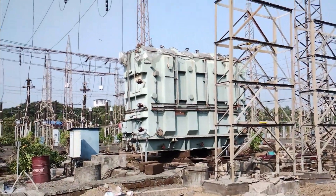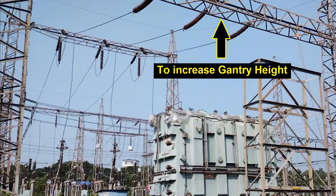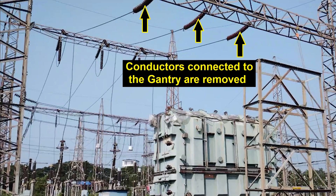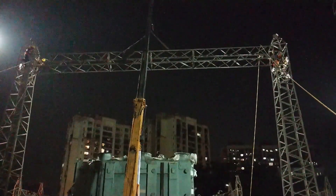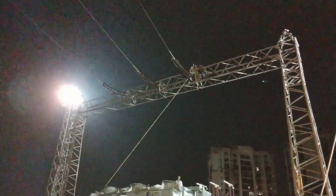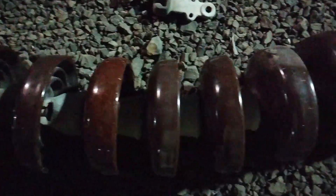In this case, the gantry height is not enough and it is necessary to be increased. Hence to increase the gantry height, the conductors connected to the gantry are removed, and then the gantry height is raised. This heavy task requires immense accuracy. The conductors are connected back to the gantry. The insulator discs of these conductors are checked thoroughly before connecting.